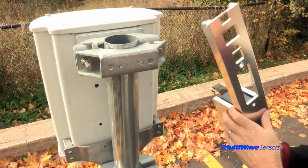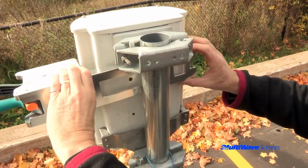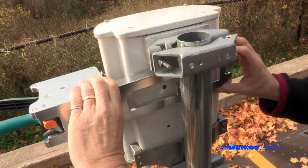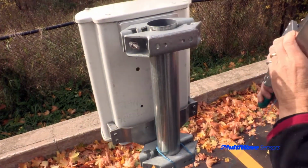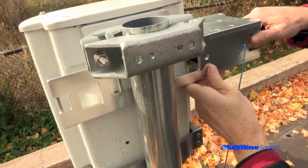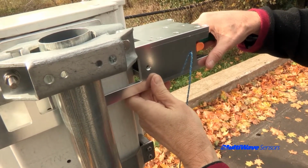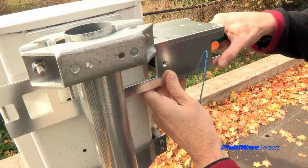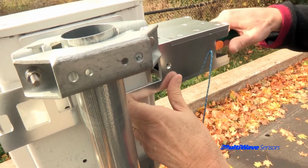Since the bracket handle can be on the left or right side of the antenna, you could choose a side based on available space. For example, if an antenna is right beside the antenna you are measuring, orient the handle on the other side. If space is not an issue, use whatever side is easiest for you to operate the ratchet with one hand. You also want to avoid having the channel make contact with any fasteners on the back plane of the antenna. The channel edges must be flush with the antenna backplane.